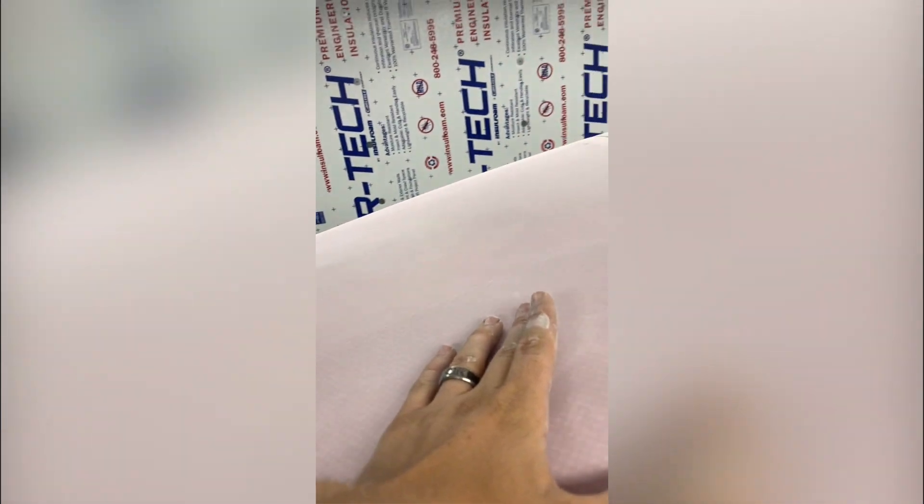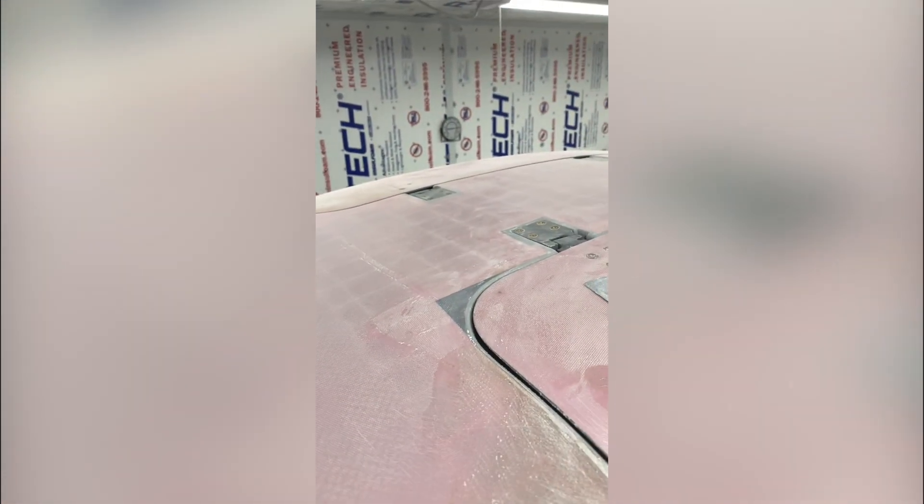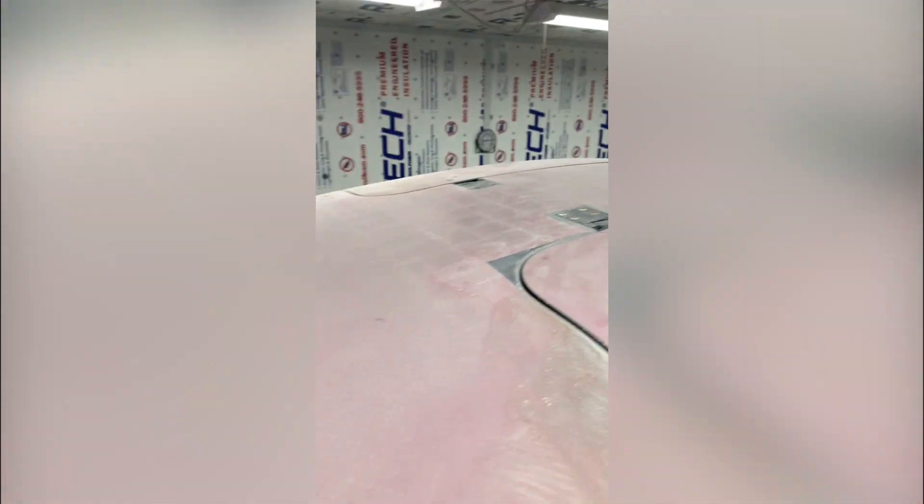See how this side is all flat with no shine? Go back here — see how it's like super reflective? The epoxy won't stick onto the shiny stuff hardly at all, so you have to sand all of it down to a nice matte finish and then it should be good.